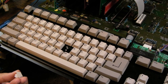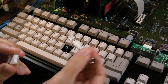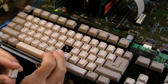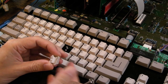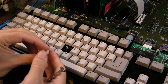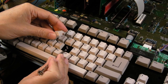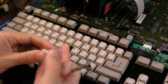And they're also known as the Chicken Lips keyboard. And yeah, I am going to have to be careful how I reassemble this now. Because the chicken lips here, those are the chicken lips. And it's 2 contacts that separate, actually. Right now they're joined. Oh, so much for trying to demonstrate this. So I need to carefully extract this Space Invader bit in order that I can carefully put this back, and it's going to clip over into the key there, but I need to separate these two connections here. These are the chicken lips, two contacts that join together as the key.